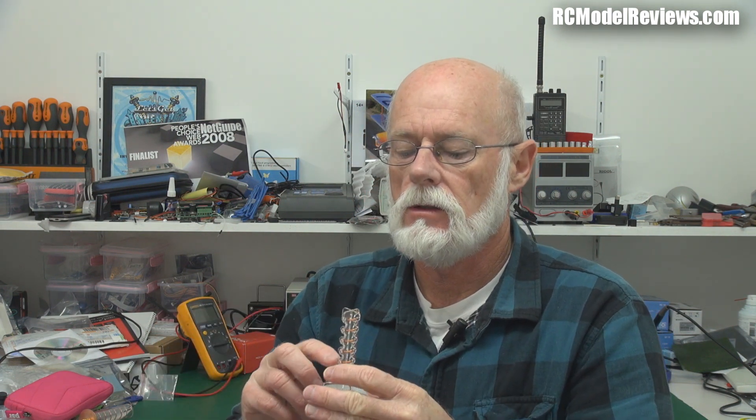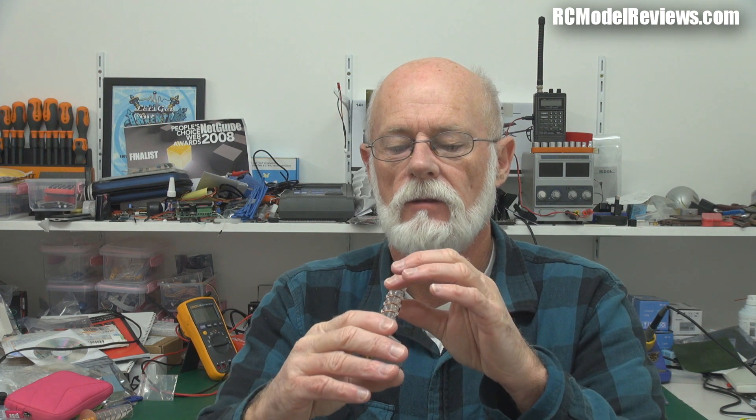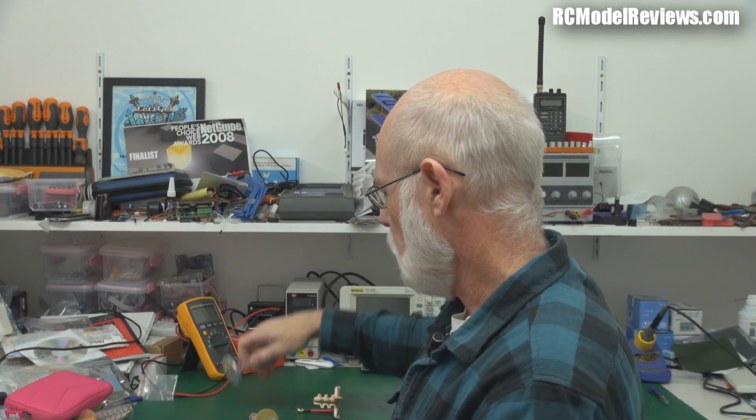The Circular Wireless antenna — how many turns is this? One, two, three, four, five, six, seven — that's nearly eight turns, so about a seven-and-a-half to eight-turn helical. Look at the different construction techniques: it has a clear acrylic former to hold the copper wire, and that wire is enameled copper so it won't oxidize. It's got a solid aluminum base plate — quite rugged and strong.